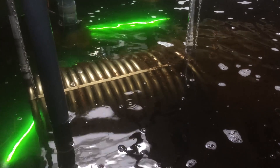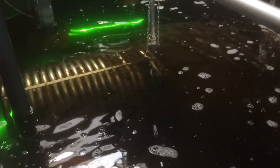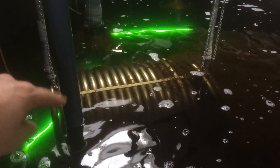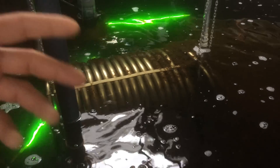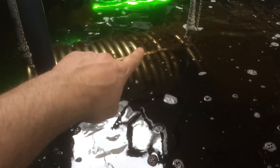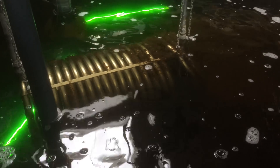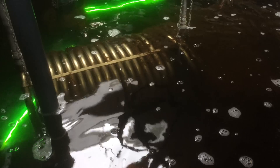Hey everyone, thanks for watching again. I'll explain a bit more about the heating system here and UV filtration - you can see the two Star Wars lightsaber-looking things in the tank. These are 125-watt UVC lamps. They need about 30 seconds retention time, which I can't achieve here because the water flow is much too high. We have brown algae due to high silicates in the water and also high nitrates - basically a perfect breeding ground for algae.